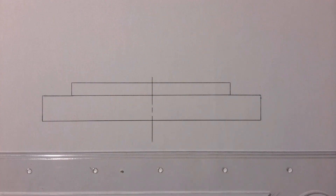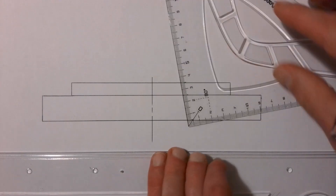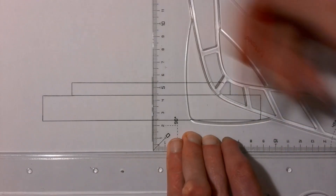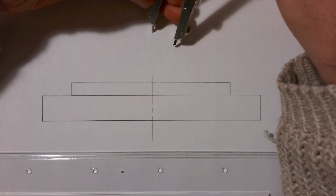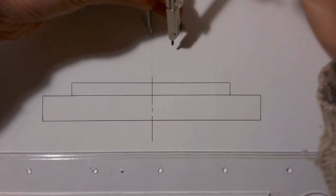Your starting point has to be the center point of where your bolt and nut is meant to lie, and we've got the center line here. You'll start by drawing a construction line going up from that center line, and then you are going to draw the top view of your bolt and nut first. You'll start with the circle that you need to be able to draw the hexagon for your top view.